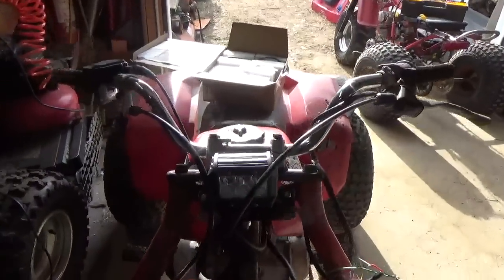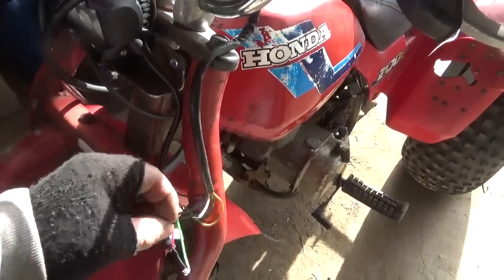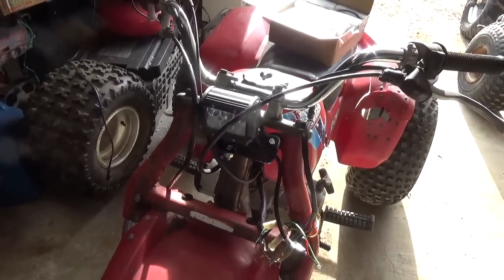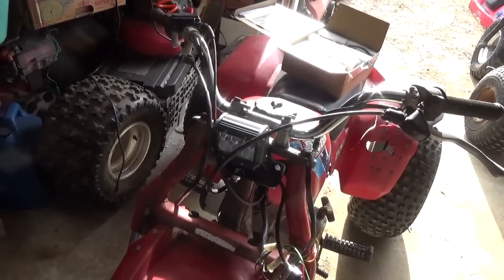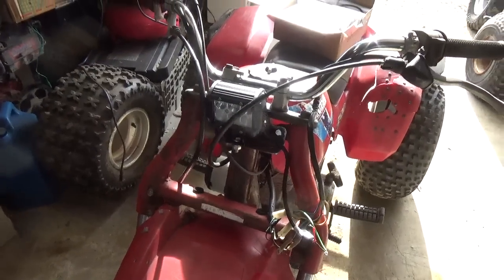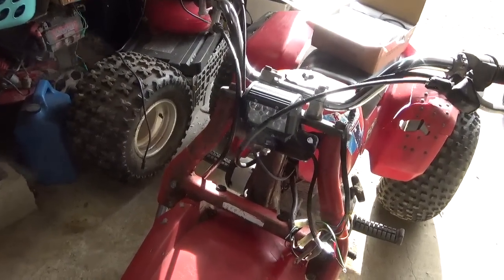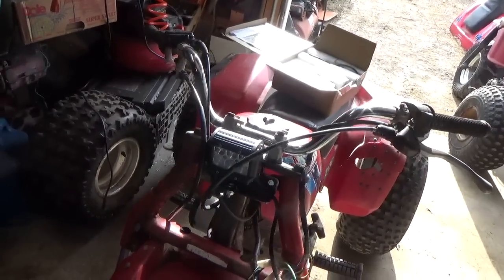What's going to need to be done is I'm going to have to come up with some kind of DC-powered circuit — basically have the AC go into a little circuit and work it that way. My comment to anyone who says you can just put an LED directly on an AC circuit: I didn't think it would work, I just did it, and it does not work. You really have to do a little more than that. You're basically putting AC power into a DC device and they don't like it. It's already starting to fog up — something is getting ready to go pop.